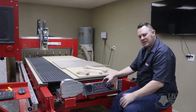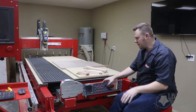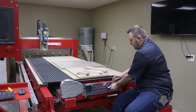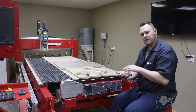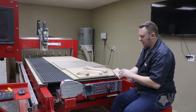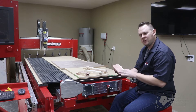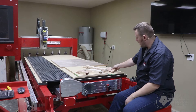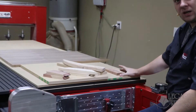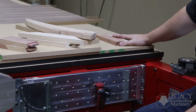When I say workstation, there are three workstations as part of the machine. We're not going to go into detail on all of them, but each workstation allows us to work on different surfaces of the part. For example, if I have this component and I wanted to work on this larger flat surface, I would place that on my horizontal table — that's workstation number one — and there I can work on my flat surface.